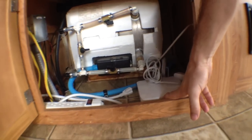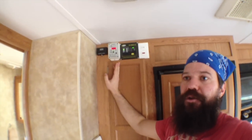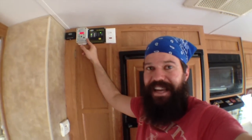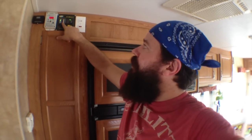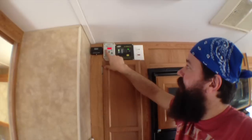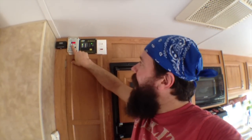Underneath the refrigerator we have our hot water tank. I've got the Wi-Fi set up to that solar charge controller - it broadcasts a webpage of what the solar charge controller is actually producing in real time. Up here above the pantry we've got the solar charge controller information and the battery monitor that comes off of that shunt. Right now we're at negative 0.5 amps with a fan running and the inverter running. This is the inverter remote control switch so I can turn it on or off from here. The sun just came back out of a cloud, so now we're producing 6.9 amps of power, we're at 99% full on the batteries, and currently at 13.2 volts.